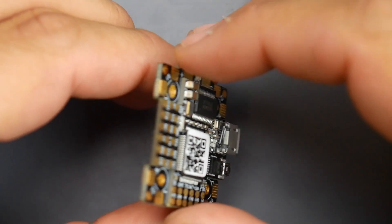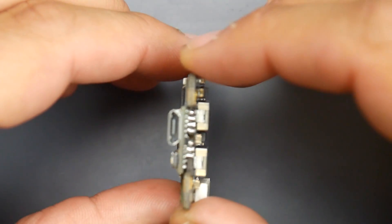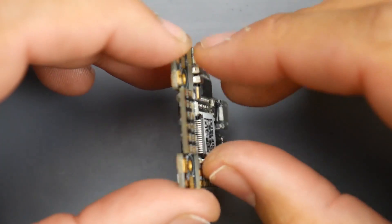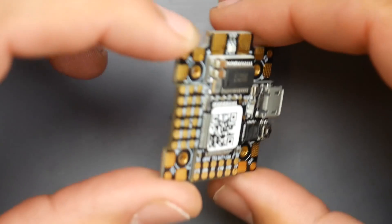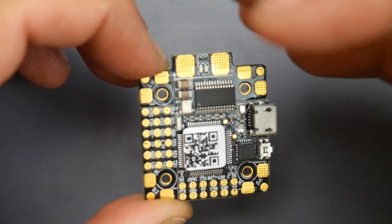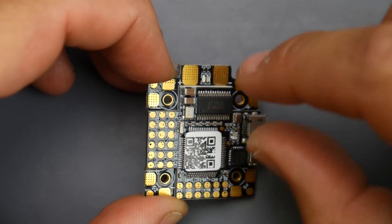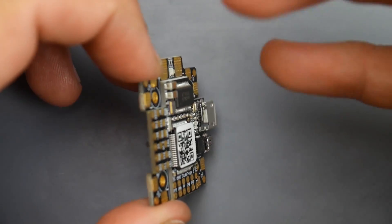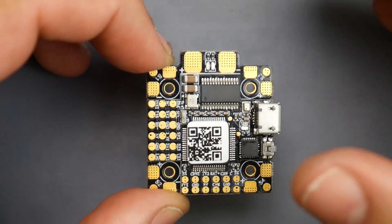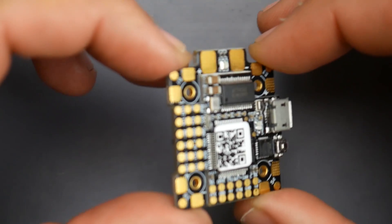The design uses a double PCB board — we're seeing this quite often now. We have the main power board and then the logic board separated. This is very good. What this allows is much larger copper traces inside — consider them like fatter or bigger gauge wires inside the PCB — in order to get the best power delivery and least amount of resistance, which is something you always want with all-in-one flight controllers.